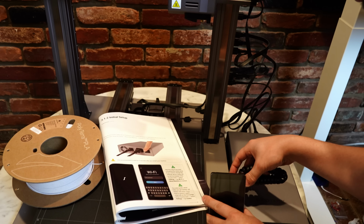So the whole thing about poka-yoke that I've brought up multiple times, you know, idiot-proofing your assemblies. Well, take a look at this. These are supposed to be up here, and since there's so many bolts in that linear pattern, I accidentally installed it an inch back from where it's supposed to be. So that's kind of a big setback. I've got to unbolt all of those things on the bottom, shift that forwards, and then bolt it down again. Yeah, that's a lot of bolts.